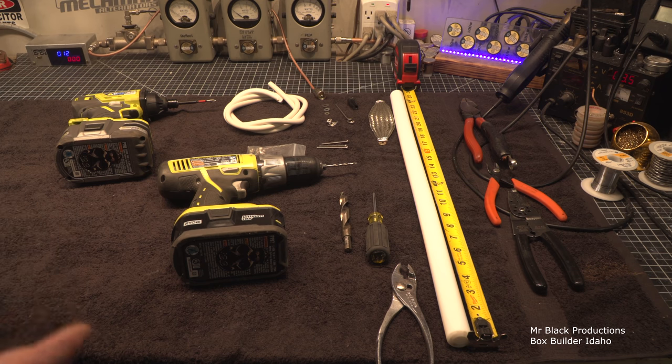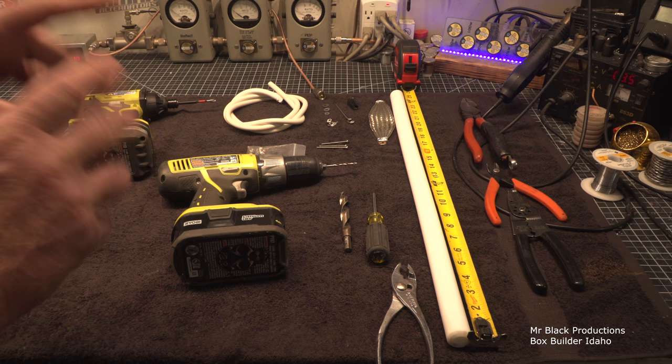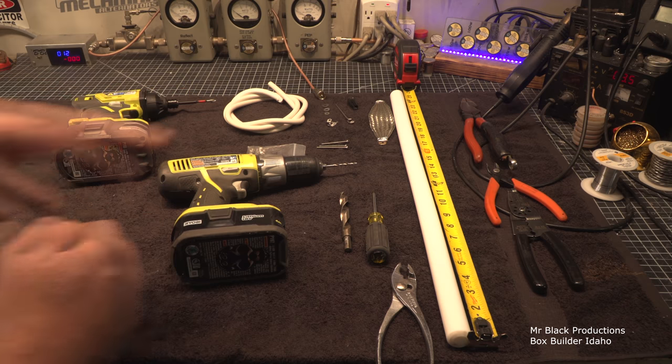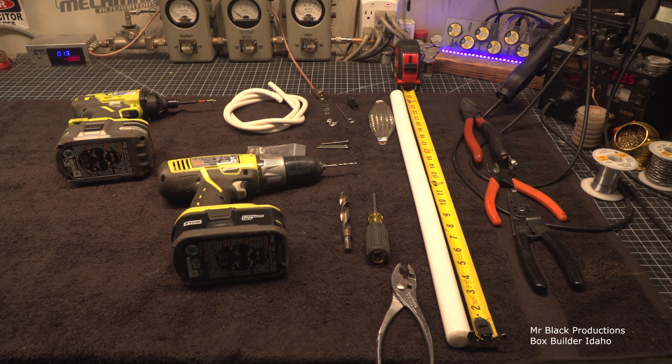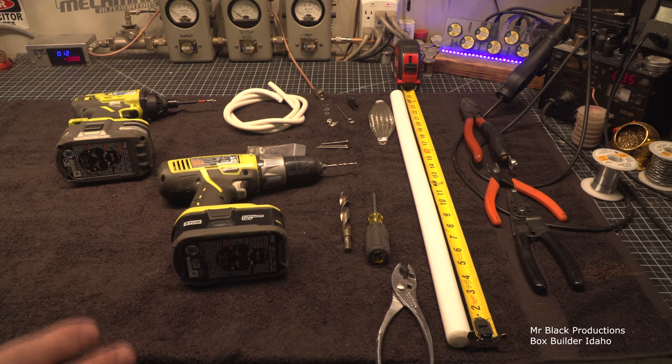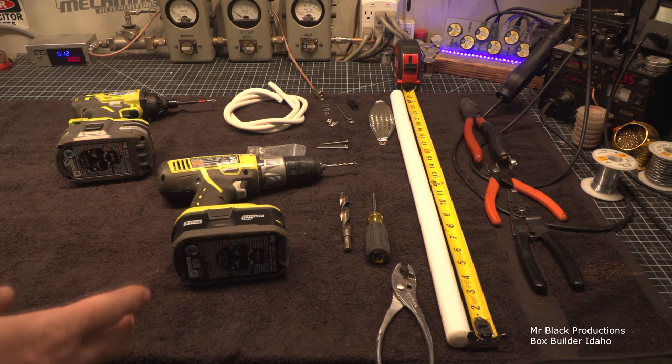It's got a really high dielectric breakdown. Dielectric's a fancy term for resistance, by the way. Electrons don't want to crawl on it very much. They can't conduct over it. They can't stack upon it for the most part. It's a wonderful insulator. So in a round application, now we're going to talk about surface conductivity, which is roughly but not the same thing.